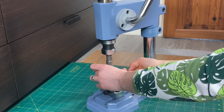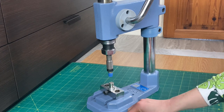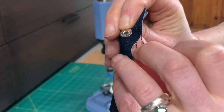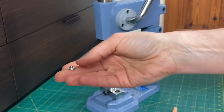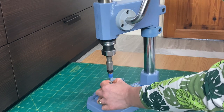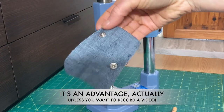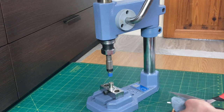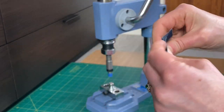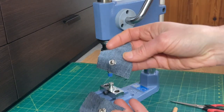We've got the post, fabric sandwiched in between, and the stud. Using the press is extremely easy — everybody can do it, there is no learning curve. Advantages: it's very easy to use, you can change dies quickly, adjust the working height, bolt it to the work surface, adjust the T-slot precisely, and adjust the stroke force. Disadvantages: it's very heavy at 20 kilos, and it's quite expensive — I paid 300 pounds, though I got 19 sets of dies. Other than that, I don't think there are any disadvantages. I've been using it for two years and I love it. If you have any questions I can make another, more detailed video.